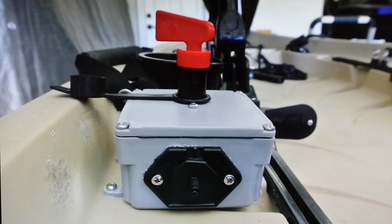This is the completed and installed junction box for the kayak. You see the 12 volt socket on the front face and coming through the lid is the kill switch with the red key on top. There will be a lanyard attached to that so when you pull very slightly on that key, it will disconnect the power to the trolling motor. If you have any questions, please leave them for me in the comments. Thank you.